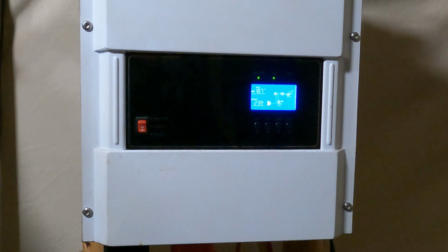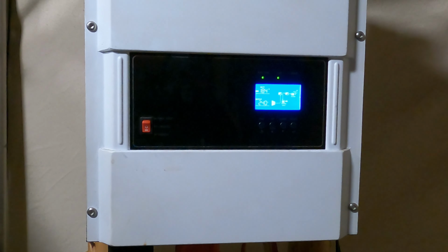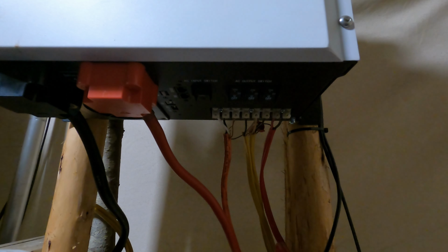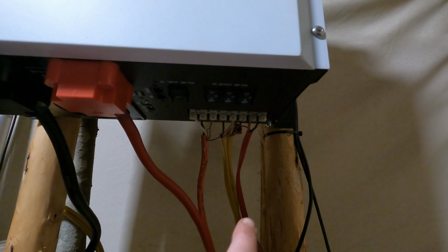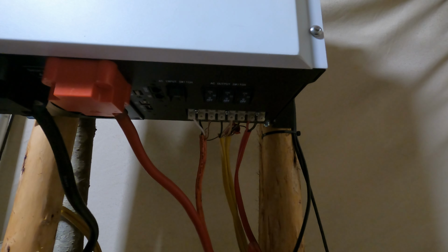I've only got about 6 kilowatt hours of battery, and lead acid at that, so it's quite important that I keep them charged. My plan is to take that 120 volt output, rectify it, and then feed it in on the same line from my solar panels. Obviously I'll disconnect the solar panels whenever I'm running the generator.